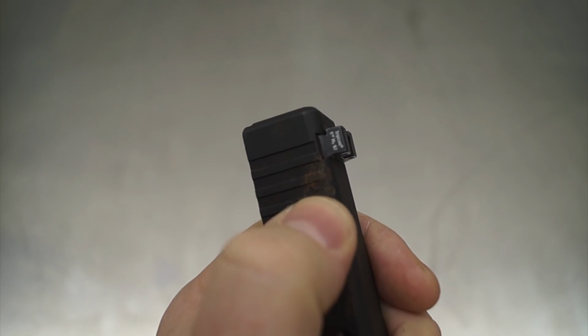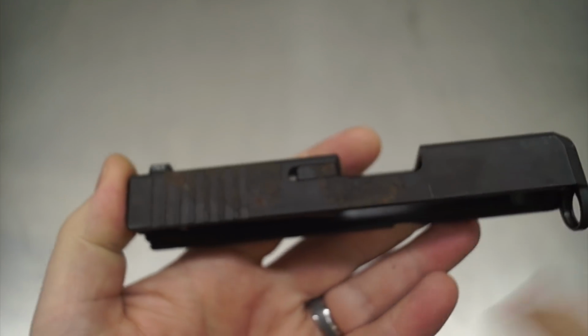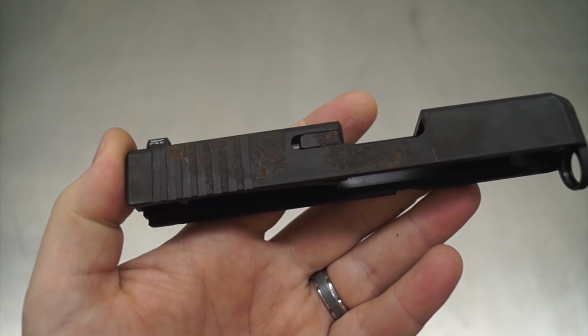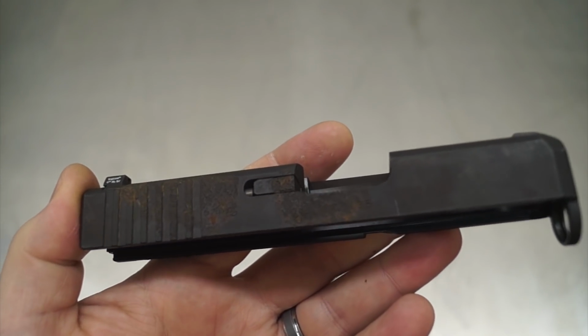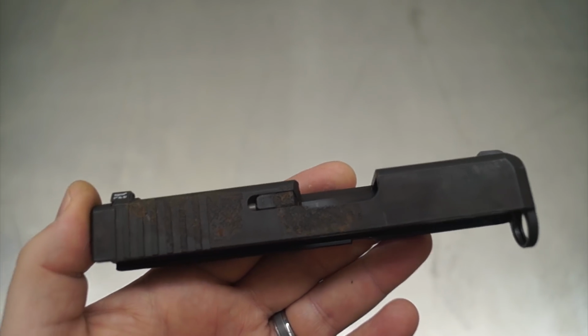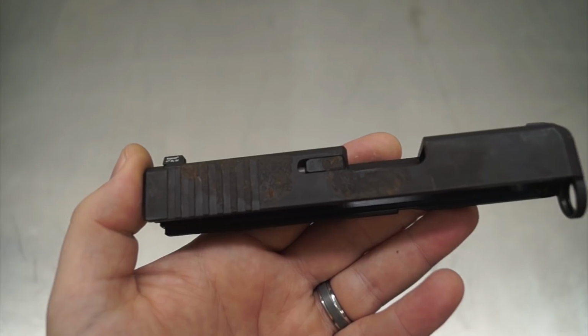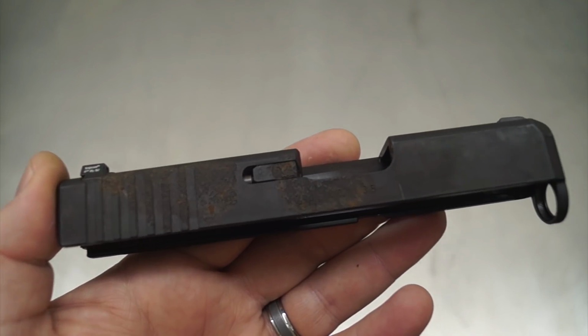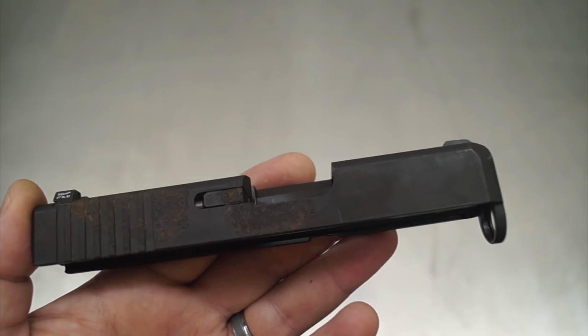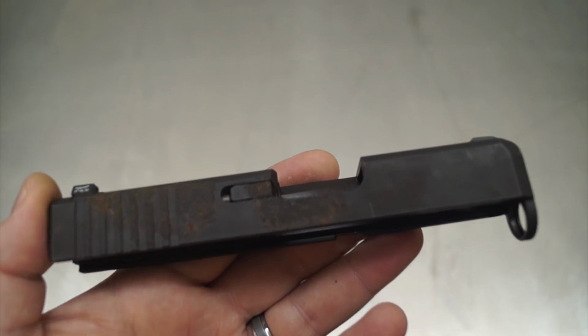Some of this pitting is on the bottom side, on the low side. So it's not going to be as easy as just shaving off the serrations and hoping that the top side clears the problem. We are going to have to actually get into the low side, and there's really just not a nice way of doing that. So we're going to end up probably utilizing the laser to do some sort of a grip upgrade texture pattern over it, hopefully also absorbing a lot of that pitting at the same time. So I think that's probably going to be our best solution.